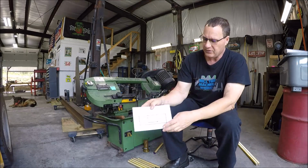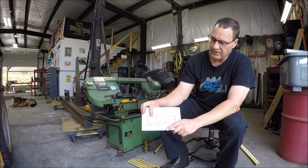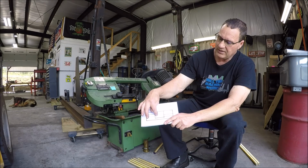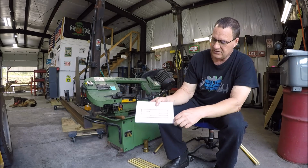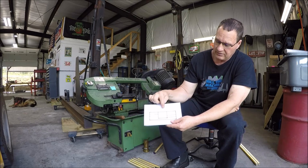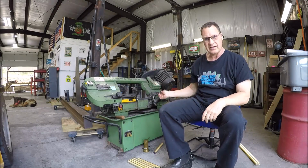And then on top of that, I don't have a blackboard like Rusty Knox does, so I made a quick sketch for you. So imagine this is the knob, this is the bore that it sits on the threaded rod. Now the green is showing the way they should have done it and drilled accurately so they could split this bore so the set screw would have a nice positive engagement on the D-shaped shaft. Well, instead on mine, the red illustrates that they got it off, so on top of the knob starting to crack, it doesn't have any real good engagement on that D, and of course it doesn't stay on, and I have to use a pair of pliers.